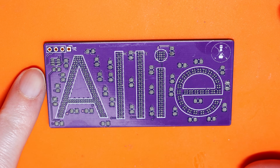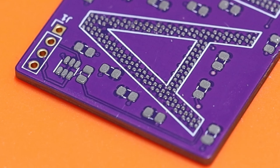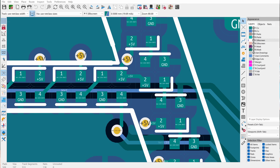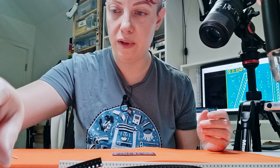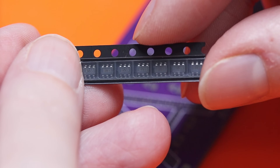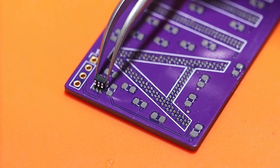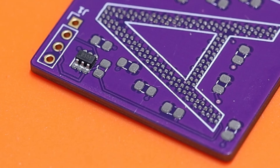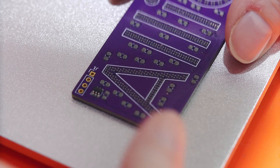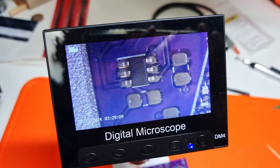This is it. I just have to get in. It makes sense to start in the top left corner and work my way down. It goes without saying that the LEDs are the hardest thing to place here because they have a direction — they have to be placed in the right orientation or nothing works. And there's over a hundred of them. You can see where this could go wrong real frigging quick. First up is the little ESD chip, which is probably the biggest thing on the board. Look how small this thing is. Let's pick this guy up and gingerly set it down. A little push. I mean, we got there, but I'm not entirely convinced I didn't screw up the solder paste in the process. I definitely messed it up. Two boring minutes later — now I think we might be okay. You can definitely see it's in place and it's got solder paste in most of the right places. I just have to hope this is going to work.